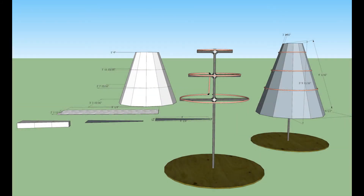Projects typically start out with drawings in SketchUp or some other 3D CAD program, so you get an idea of relative sizes and a visualization of whether the project is going to work at all. I tend to try and get down to the level of actual plumbing fittings in that, but I don't expect it to show the final result. The next thing I do in a flame project is create a diagram that shows all of the plumbing fittings that are going to go together. I really like this to be very accurate — it needs to show what parts are required, all the way down to the brass bushings or adapters.